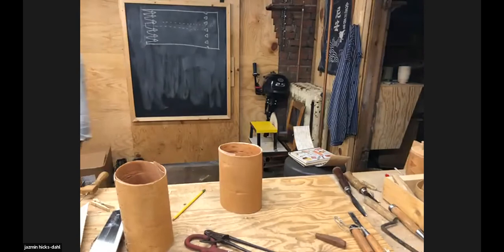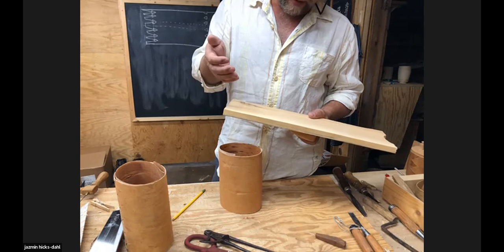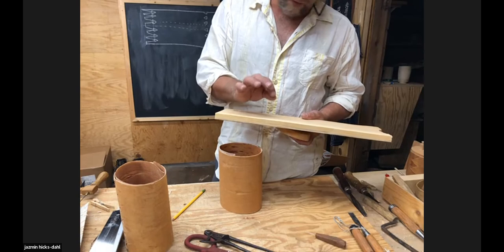You know, so the base material is approximately 1/4 to 3/8. You don't want any thicker than that. And it's going to be a softwood: pine, conifer, cedar. And then the top lid should be 1 inch or so. It could be 7/8, might be even better. 3/4 is too thin. So that's kind of the rub.